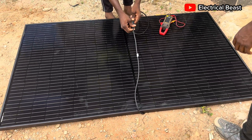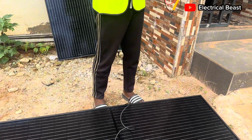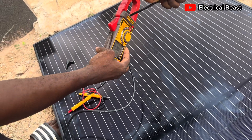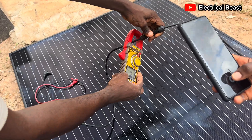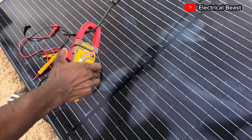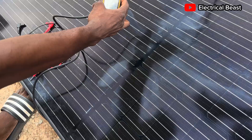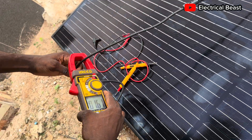So these ports are negative — short-circuit. With your multimeter, take it to current measurement. To get accurate readings, short-circuit current — as of now we're having two amps. The time is just past 11 and the sun is not out at the moment. When we have more energy from the sun hitting the solar panel cells, we'll definitely have more current. It's fluctuating around 1.6 to 2 amps.